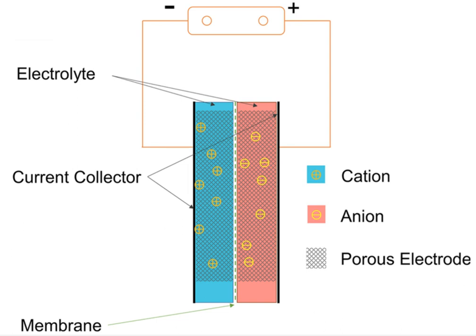More research was focused on transition metal oxides such as MnO2, since transition metal oxides have a lower cost compared to noble metal oxides such as RuO2. Moreover, the charge storage mechanisms of transition metal oxides are based predominantly on pseudocapacitance. Two mechanisms of MnO2 charge storage behavior were introduced.